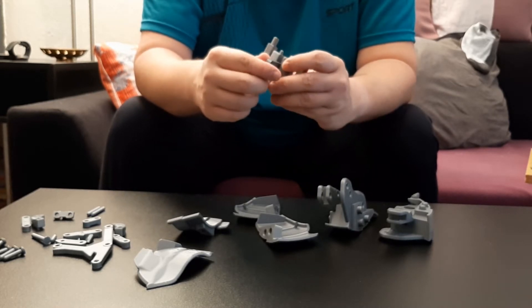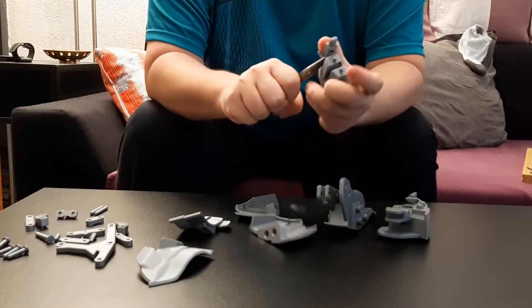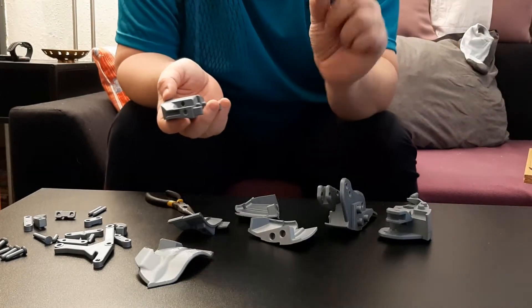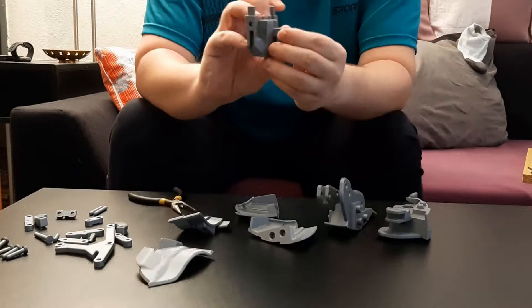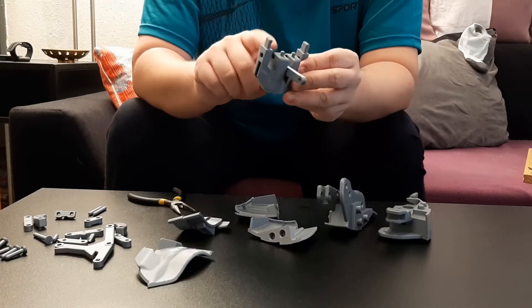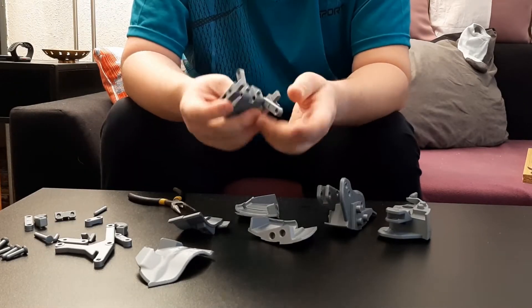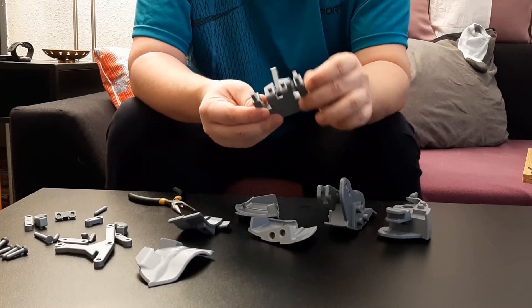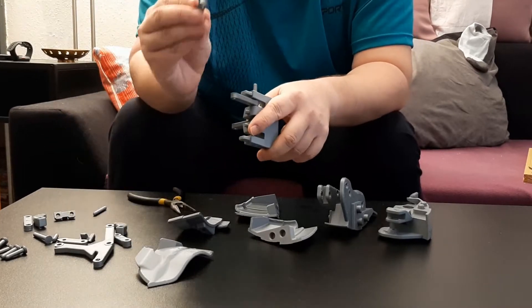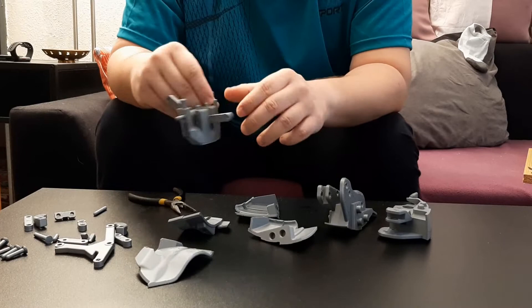As you can see it wobbles quite a bit. That is why we will use the pliers and move the shaft up. And we have to use the washers that I've been mentioning — those are the washers. First one is done. Now we have to attach two more here. Done. We will not push the shaft the entire way down, because here we will have another part — another link, this one, number six. So we will not push it all the way down, but we will focus on the second link.